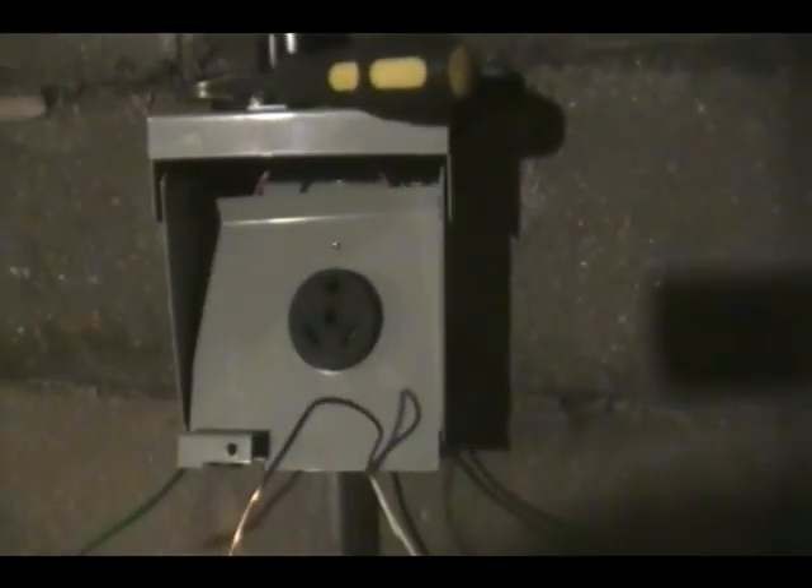That's what the plug looks like. I'm going to go ahead and set this down and pull out this plug right here. As you can see in the back, we've got three different terminals — one, two, three. As you're looking at it, on the very top you've got the ground, and then you have a neutral and the hot.